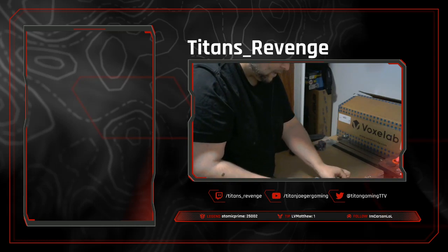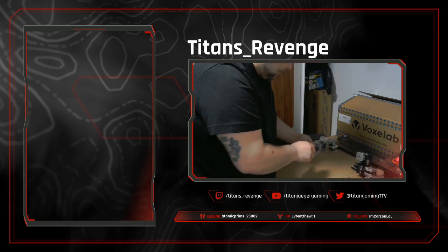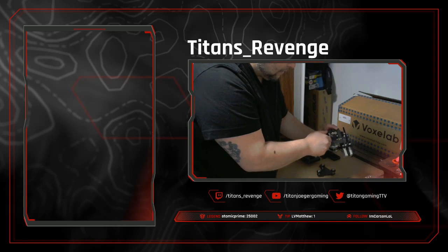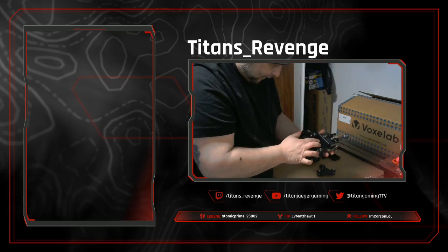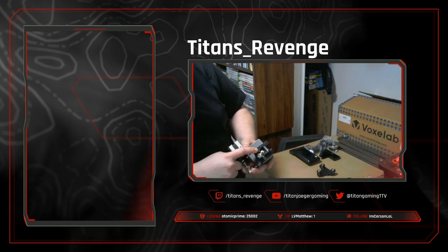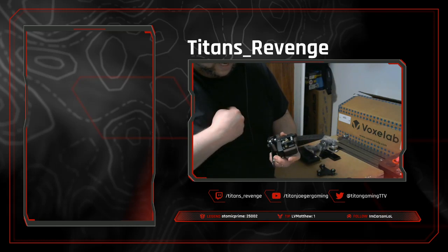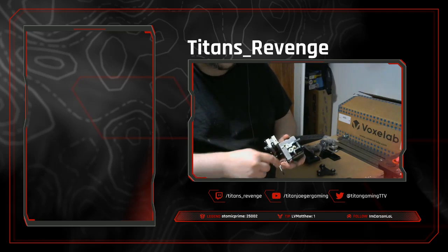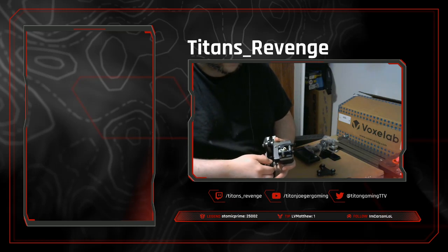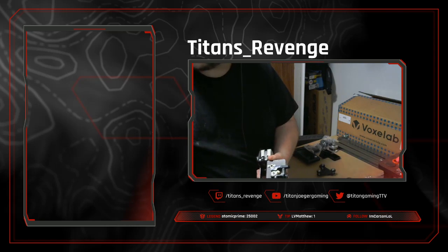Like I said, there are certain things that you'll want to change right off the bat if you consider purchasing one of these, and that is changing out this plastic extruder for an all metal one. And I know a lot of people say, well, why don't you just use that plastic extruder until it breaks? But the problem is you don't know when it's going to break, and it could break and ruin an entire print that has been running for a couple of days, and then you all of a sudden have wasted your time. So I personally would much rather take this off, swap it out, and have this as a backup. I'll have my all metal one on here. That thing will last a good chunk, if not forever. But if anything ever does happen to it, then I can throw this plastic one back on as a temporary solution while I wait for another metal one to come.